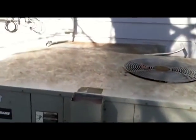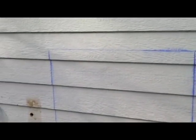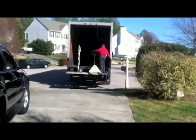I hand-dug next to the well to make sure I didn't damage the pipe. This was a good bit of work to get it trenched. Then I dug it under the foundation and into the crawl space. Here's my old gas pack unit that I replaced — supply and return duct work coming out through the wall. So I removed all that, and I already had a header in my crawl space. I was able to cut out that section of the wall to give me good access for maintaining and installing the unit.